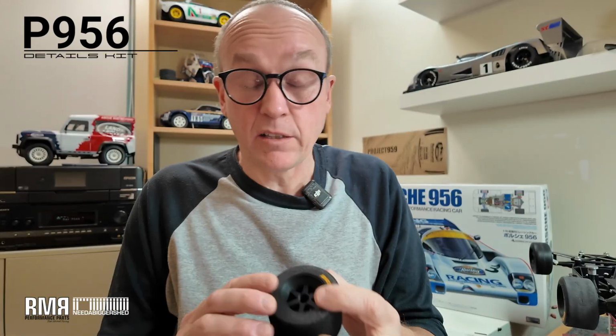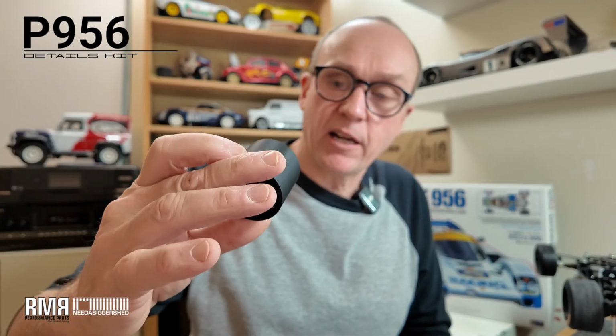I could go to more technical filaments. There are some very high spec technical filaments, but the price of that is multiplied by 2 typically, and I don't think it's needed. If anyone's buying all the stuff for this kit, they're going to drive it, they're going to roll it around, but they're not going to go racing with it. There's a big difference, because they're going to lose bits off of it. The mirrors are going to come off, all the details are going to get smashed and come off. So it's always, where do we go? Now, I'm not big enough to get these things injection molded. I have contacts where I can get low volume injection moldings done, but still, it's going to be prohibitive. They're made chunky enough, the wall thicknesses and everything are chunky enough, and lots of supports inside there to run.